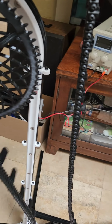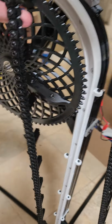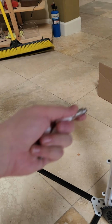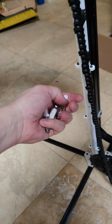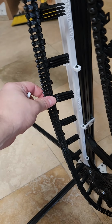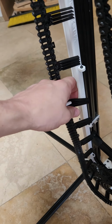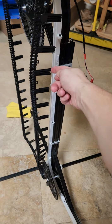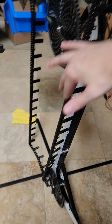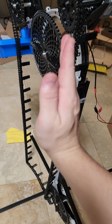In this middle area where the chain hangs down, what we're seeing is when multiple carts get in there, they are essentially exerting an outward force on the chain and via the brush. And what that does is create a bulge in the chain profile where it comes outward.